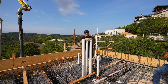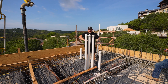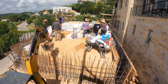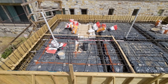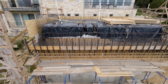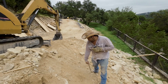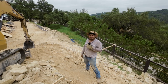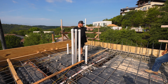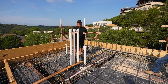All these pipes you're seeing are a variety of pipes for returns, jets, and drains, and they're snaked through our whole foundation. The guys come in, they bag everything up, then the plumbers come in, destroy parts of those bags to run the pipes, and we re-bag it on top. All these higher areas have relief for the grade beam in that hash-mark pattern around the foundation. You build it up with sandbags to get those deep beams that hold the structure. These beams make up the beams of our spa, and there are always beams around the perimeter with beams through it that join everything together and add extra strength.